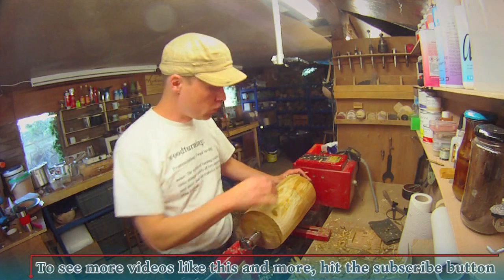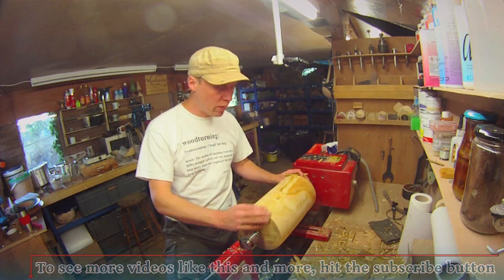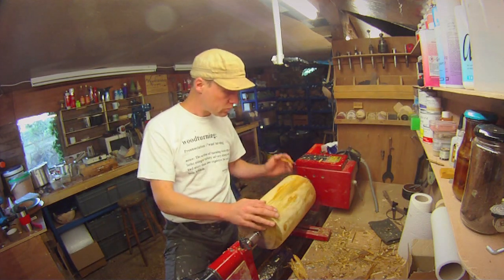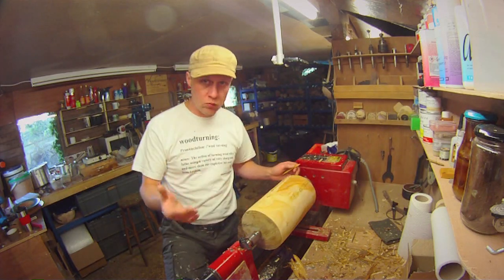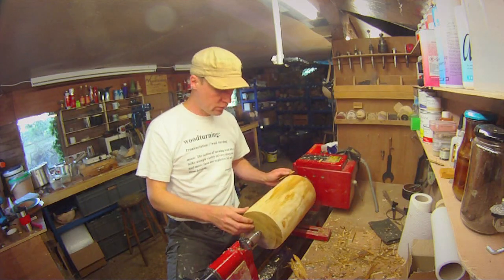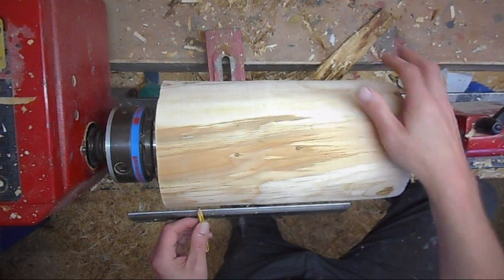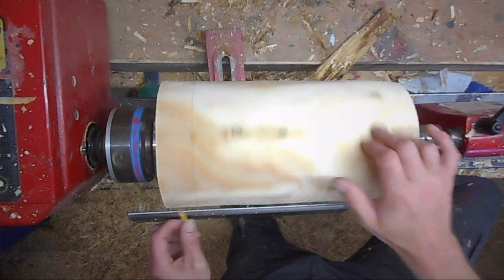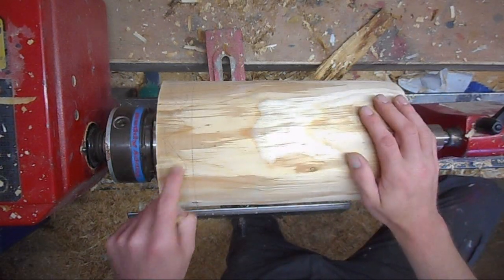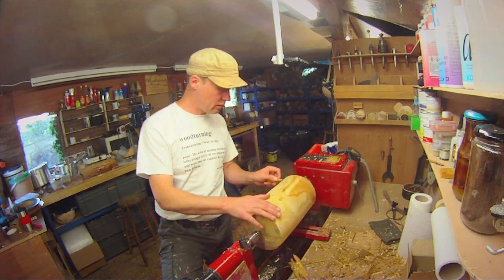Here we are rounded down to a reasonable cylinder. It's a lovely wood to work with — quite soft and as you can see it's quite pale. It's fairly dry at this end but fairly wet over here on the left. Now I need to work out where I vaguely want this vase to be. The screws in here are about an inch and a half, so I've got a safe area here — actually that's the danger area down on the left, so I can't part off down there, but I can part off anywhere in this area here.